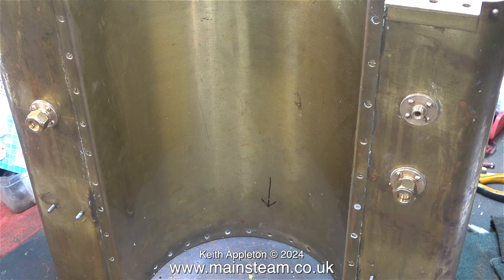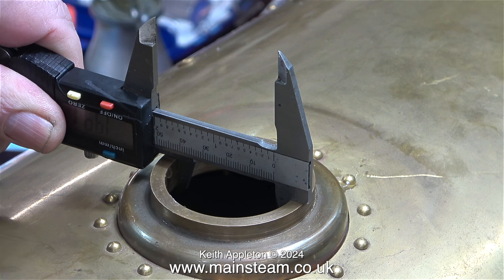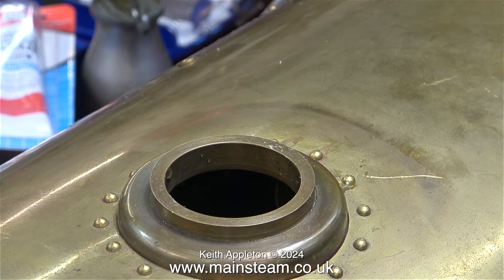What I wanted to do in the first part of this episode is give the silicone rubber time to cure. I showed that part right at the beginning, and now I'm pretty sure at the rear corner where the tank meets the cab, there is enough silicone rubber to waterproof it. I was getting really paranoid with this job, and I was so pleased when I only got one leak on one corner.